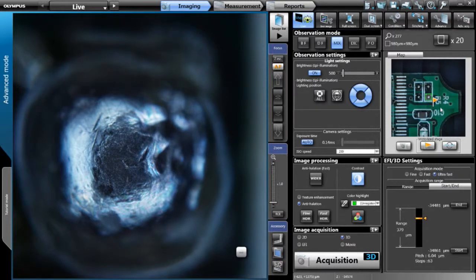Another new feature is the 3D or EFI settings. Previously there were fast and fine scan modes to acquire stitched images in Z to create an all-in-focus or three-dimensional image. Now there is a new mode called ultra-fast, which takes the same algorithm used for fine mode capture but scans with no pause — continuously from top to bottom. This gives infinite depth of field, essentially, from top to bottom across the travel of the system and working distance of the lens.